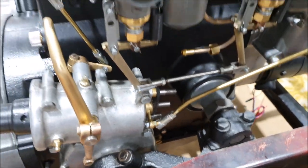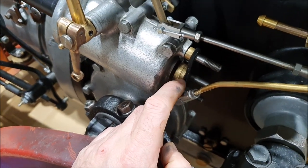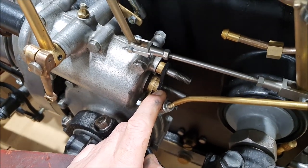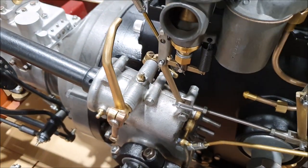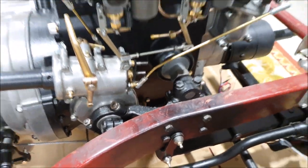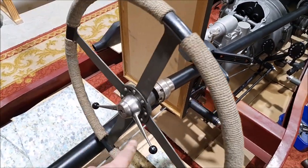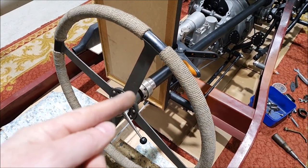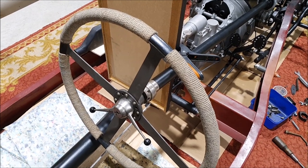The second lever is for the advance. I laser-cut some leather washers and they sit between the housing and the little arm and the back plate — I put them on both sides. They've been oiled and what they do is provide enough friction as well as an oil seal to stop any steering box grease coming out. That's what provides the friction in the system so that when you turn the steering wheel the levers don't move, because you've got the shaft for the steering column — which is hollow — and then you've got these two control shafts running down the middle of it.